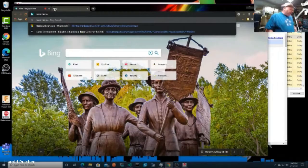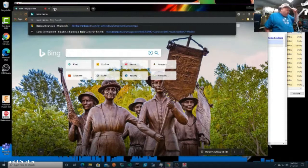Can you look at the chip on your motor controller and see what chip they're using? It's an Atmel chip. Basically, it looks to me to be a little Arduino. I haven't looked to see what the actual driver chip on it is. If you have another chip, you could probably make that program work for almost anything, unless they've got some specific key that you have to have for it to work, which I would think they wouldn't put on a motor controller, but you never know.